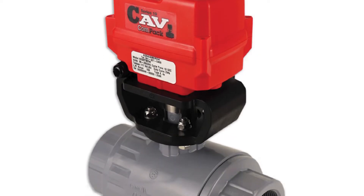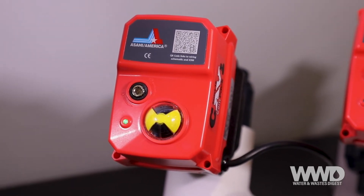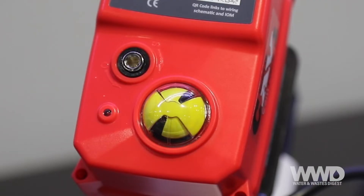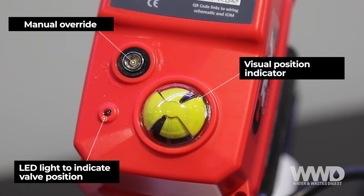The other version is the Series 19 Compact unit, mounted to our Type 27 ball valve. This unit is available in sizes 3/8 up to 2 inches and can be configured for fail-safe, fail-close, or fail-open configuration. Each unit comes with a standard multi-color LED output indicating valve position, a domed visual beacon indicator, and a manual override with included hex key for total loss of power.